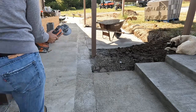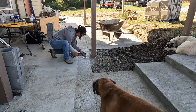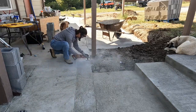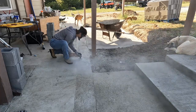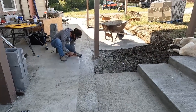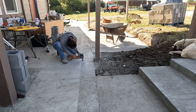So Bea's going to come in here and she's going to do a little grinding. I love that my wife's a toughie and she's not afraid to do those kinds of things. The reason why we're grinding is because any of those little bumps that are a little bit tall, we want to give those blocks a good smooth foundation. She's just going to knock some high spots off with the grinder - there were just a couple that didn't come out perfect. Then we'll be able to come back in and put those blocks in without any issues.